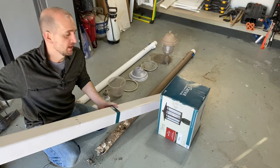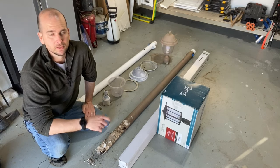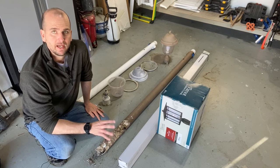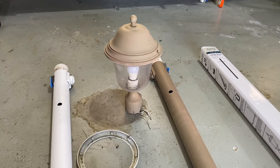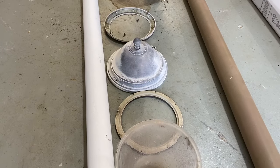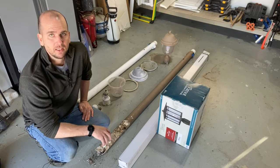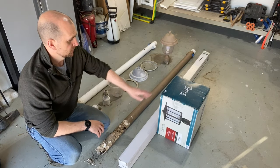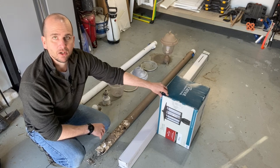I also went with a new photo relay. If you think you can reuse the photo relay from your old lamp post, you can purchase one without it and save yourself about ten dollars. Whenever I'm doing projects like this, I'm already putting in all the time and effort, so that extra ten dollars for new hardware is well worth it - but that's up to you. Also, if you like your light fixture and just need to repaint it, fully disassemble it, clean it up, rough up the surface, prime it, and paint it with Rust-Oleum - multiple coats - so it's really ready for that second life. Don't just tape it off and paint it; remove all the parts for a much better base.